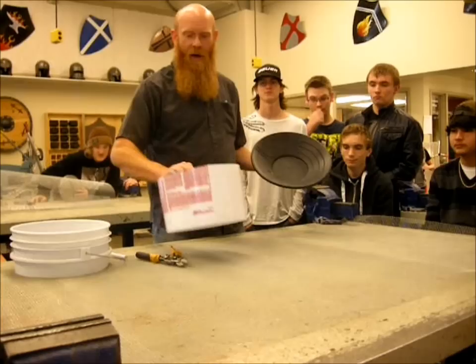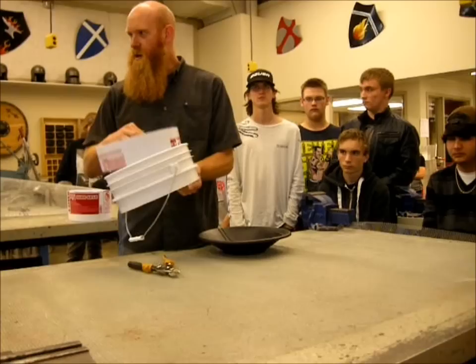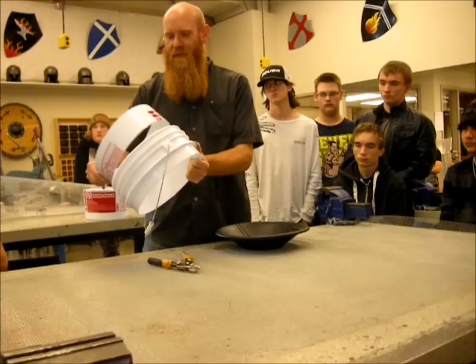Now guys, you've got your buckets all cut into three different pieces. The bottom one is just going to be used for storing stuff later. The top piece makes up the frame of our classifier. This middle piece actually goes and wedges the wire mesh inside, and protects your hands from any of the sharp edges the wire mesh will have. We'll pop rivet the two of them together later on.